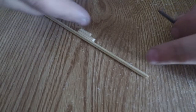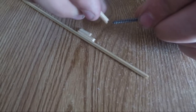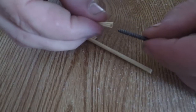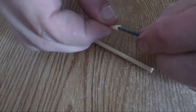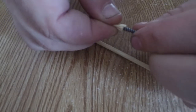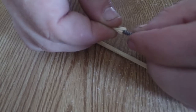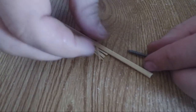Why bamboo you ask? Well, bamboo is a very long strong fiber that responds well to being tightly packed into the hole. Then when the screw is driven into the end of the bamboo plug it splinters into fine strands and expands out into the particle board without destroying any of the remaining board structure.